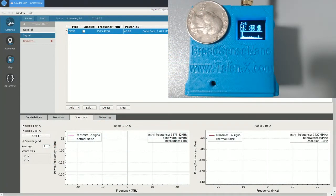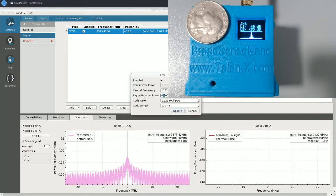I'll start with some simple BPSK jamming on L1. We're going to be looking at how quickly Broadsense Nano reacts to the change in jamming and how accurate it gets to the jamming level. This first jammer should be 40 dB J to S. I've enabled the jammer and we can see that Broadsense Nano immediately reacts. It settles for a few seconds and determines that the current J to S is 40 dB — so this is very accurate.